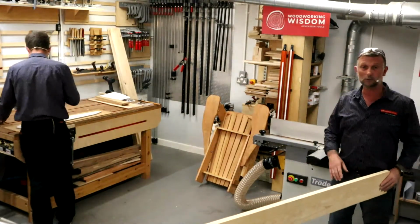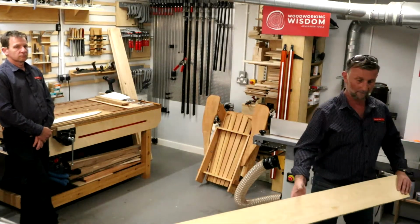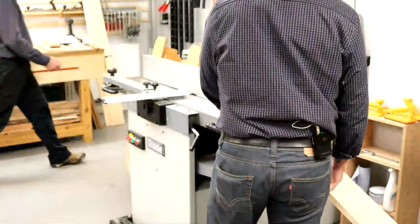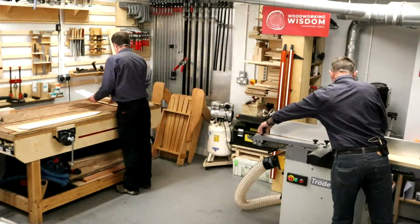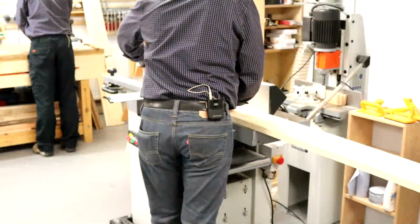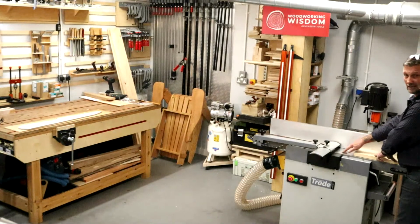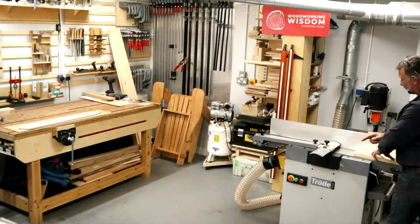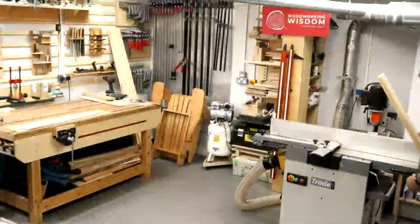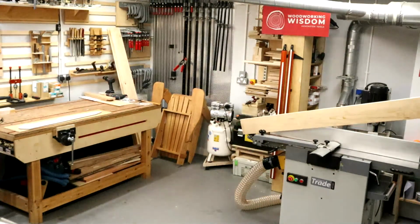I'm going to use my trusty old Axminster planer thicknesser to make this thinner, cleaner, straighter. So let's do that. So we'll go over to the planer first. All right. Now, I'm just going to set my guard just above my material. All right. So I've got my bridge guard. That's going to come up a little so I can just pass underneath. That keeps my cutter block guarded. I've pulled the fence forward a little bit, so I've got just enough blade and table and planer surface to do my wide board. The fence is locked off and the fence is nice and square to the table. I've got some good extraction, and that's what I'm going to do. I'm just going to eyeball it just to see if there's a natural cup, which there isn't, or a natural twist, should I say.